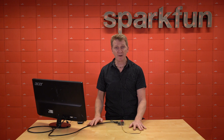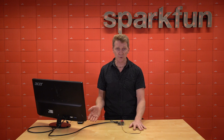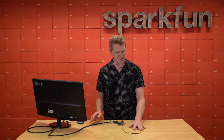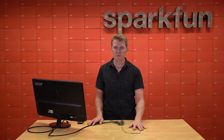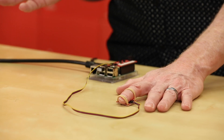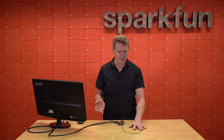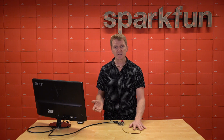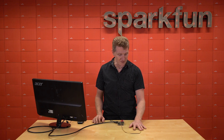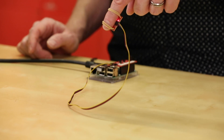I'm set up here to show you the biometric capability of the MAX30101 because it's cool, but also because it can be touchy and difficult to actually get accurate readings. The 30101 is extremely accurate and sensitive, so any movement or any change in pressure can screw up the reading. We've found the best way to do this is to tape the board down to the table — which I haven't done — and to rubber band your finger to it.